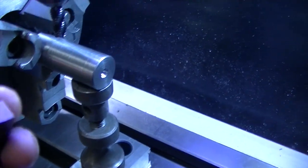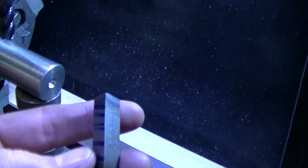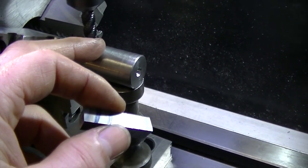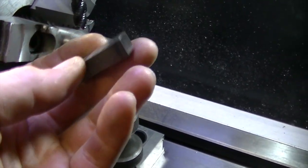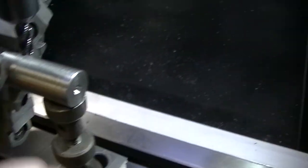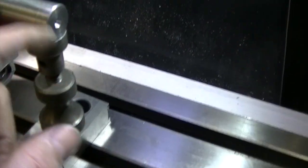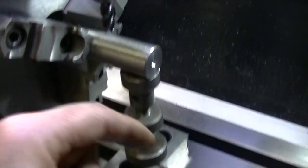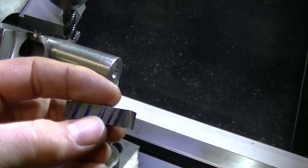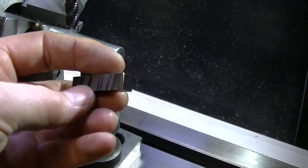When it comes time to doing this idea I had in mind — I got a piece of Rex AAA tool steel, high-speed steel — I'm going to use this to basically make my own broach. The idea is I will create a slot in here that will fit this piece of high-speed steel at the right depth, so that I can throw this back in the lathe and get a tool post grinder set up on the lathe.